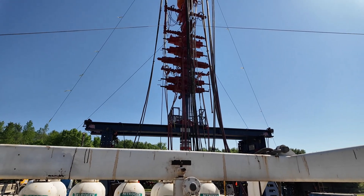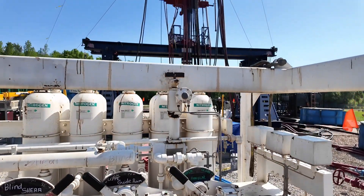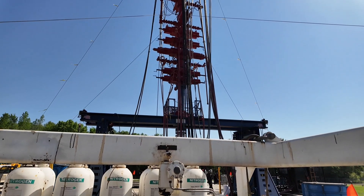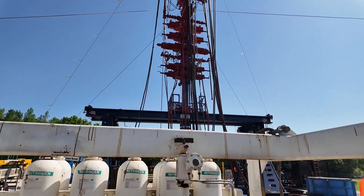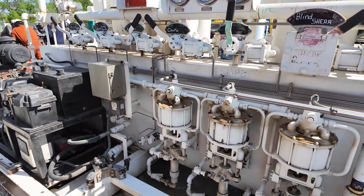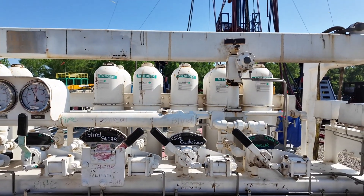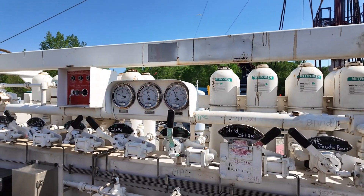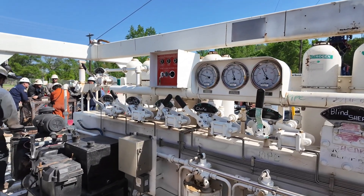I've heard it blowing over there when y'all come out. There's a bunch of hoses — it's all hydraulics and nitrogen. We use nitrogen for safety. If both the motor and air pumps go out, we still have a volume of accumulated fluid inside the nitrogen bottles. They're pre-charged at 900 PSI, and we can still operate — open and closed — without any motor kicking on or air pump. Gets you out of a bind.